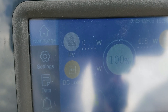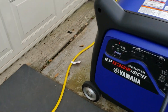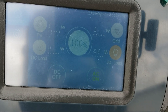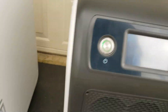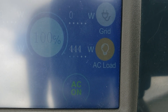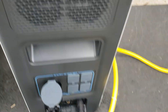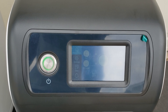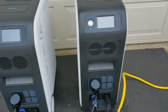If I switch to PV you'll see the PV input come on and support the load as well. Now let's see what happens when I shut off the generator. The load is still on, powering the house — the generator went off. Nothing's coming from the grid, and the load from the home is still being powered. We're back at 100% and still powering the home. Once we go back down to around 30–40%, I just start the generator, get it back to 100% during the day, and you're good — using your generator and Bluetti EP500 Pro together to power your home in a power outage situation.